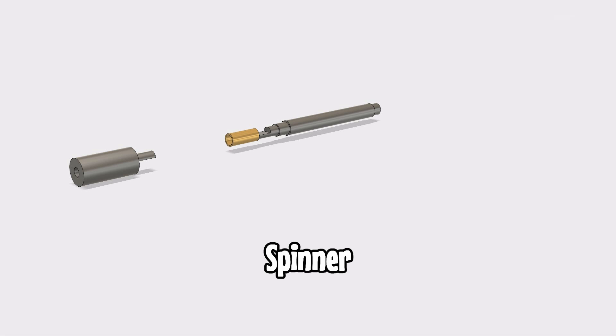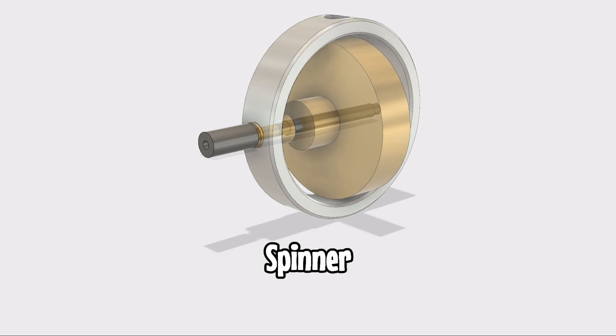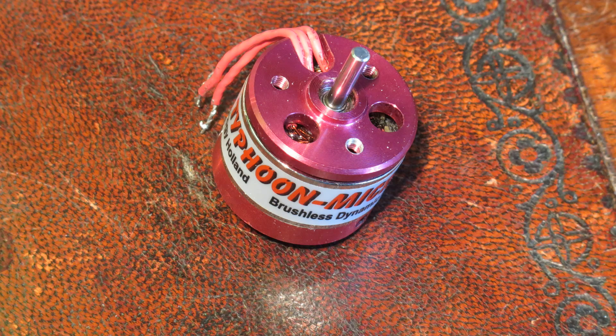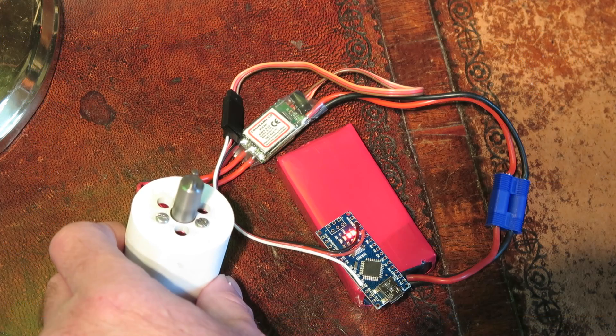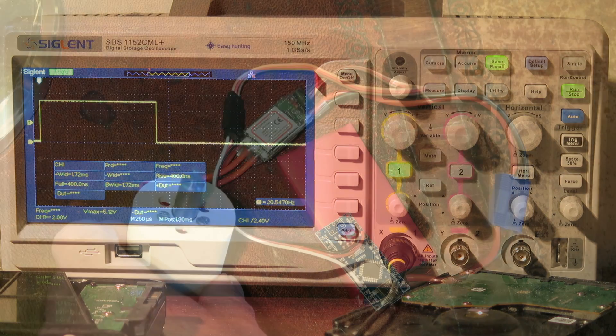To spin up the gyroscope I'm going to use an electric motor, so there's a brass sleeve over the end of the shaft and then the motor fits into the key and the key pushes into the hole between the brass sleeve and the shaft. The brushless motor runs off a speed controller and the speed controller needs a PWM signal to control it. I'm generating that from an Arduino Nano. To do that I need to write some C code that will slowly ramp up the motor speed as it accelerates the gyroscope. In this shot you can see the PWM signal that's coming out of the Arduino and the wider the pulse width the faster the motor.